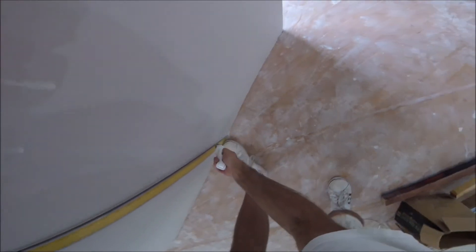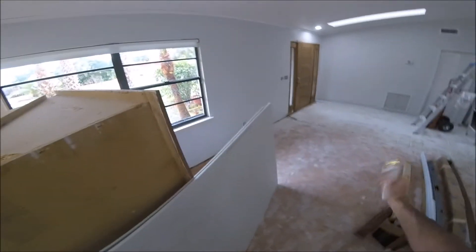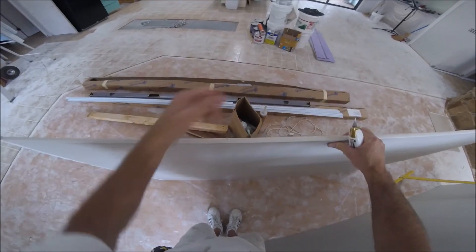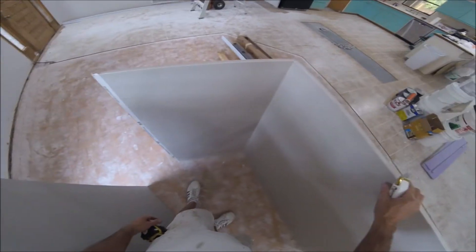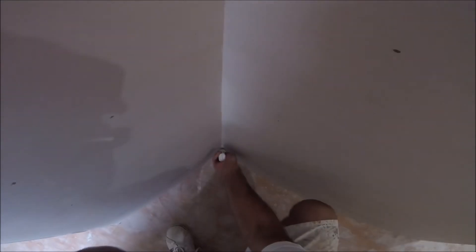Now I'm going to show you how to cut it from the back and get a perfect cut every time. I don't want to keep flipping it back and forth and cutting more — it tears more that way. So just do it five or six passes, whatever it takes. There's the cut weakening the front, which creates a line on the back to cut on. I bend it almost to a 90-degree angle so when I cut there are no chunks on the seam. Then go straight up and right out the top — keep your hands away from the area you're cutting.